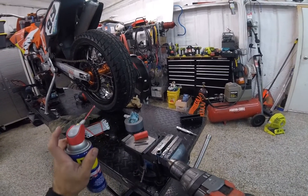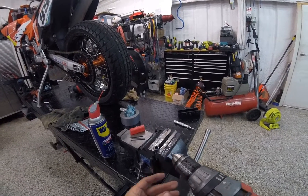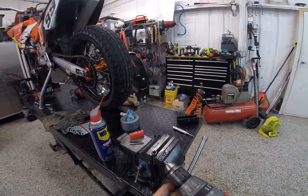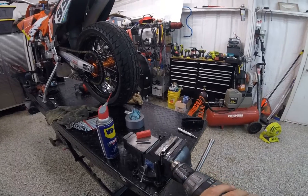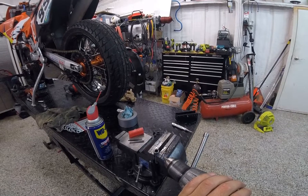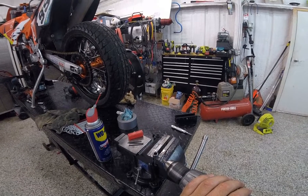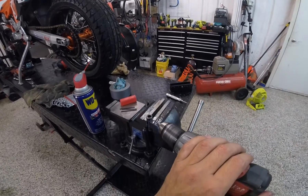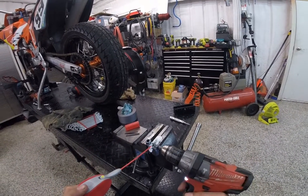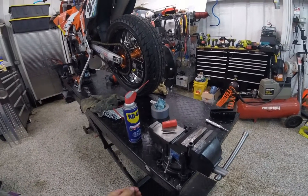Okay, that's going along quite well. I'm not putting a lot of force in it — just a little. You don't want to be pushing hard on a bolt when drilling with small drill bits like these. It's really surprising how bent the bit gets. Maybe these have all been used.